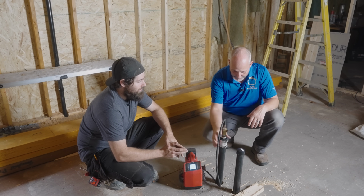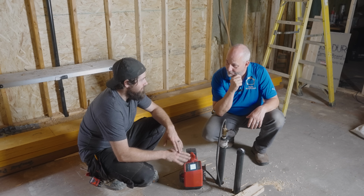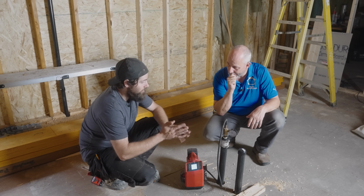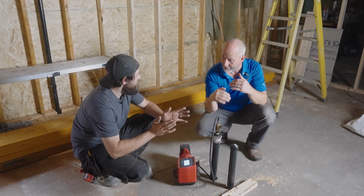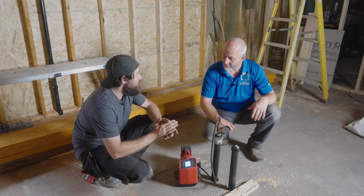So talk me through this. You got this clamped on, you're going to bring it up to how much pressure? 5 PSI. We got everything else capped off in the house. And that's enough, and we'll hold that for 15 minutes. It has to hold the pressure, and if it moves, we go find leaks.